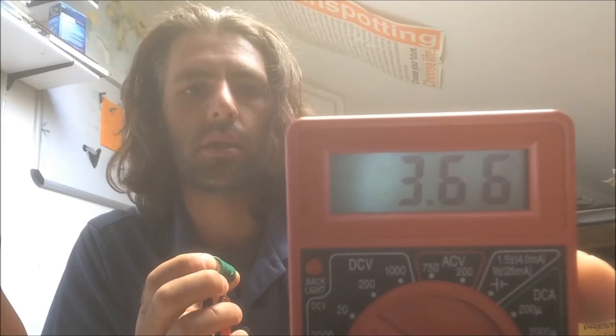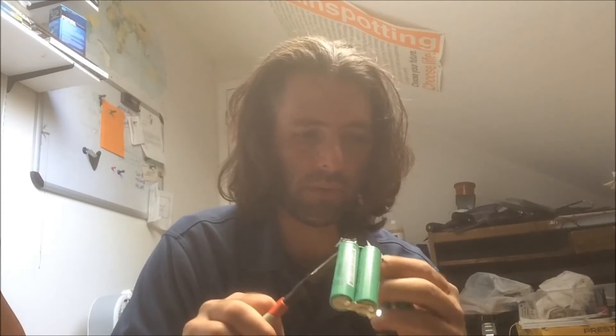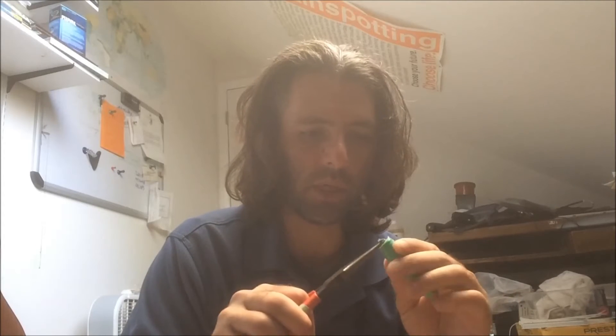Cell number one: 4.2 is the top charge for an 18650 lithium ion cell. This is reading 3.6, so that's a good cell. Anything below 2.5 is probably a little bit damaged from over discharge. I have so many cells that I think I'll be able to afford just using the ones that are in really good shape. My trash bin only has about 20 cells in it out of the 158 good cells that I've got.